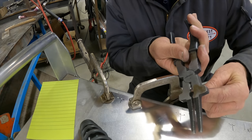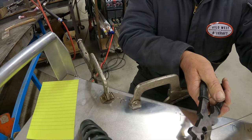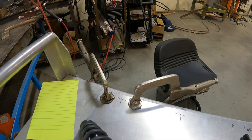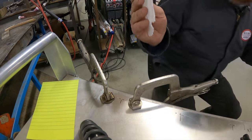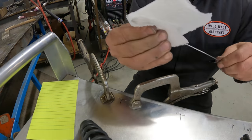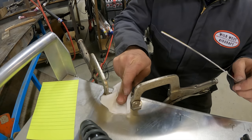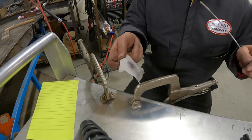Next I'm going to cut some pieces of aluminum not much thicker than the aluminum itself, but first let's clean it with alcohol. Even if you've just pulled a piece of aluminum out of an enclosed container, you can see there's still dirt and contaminants on it. I have to remember to only fill in the outside two holes, not the middle.